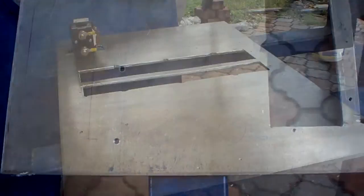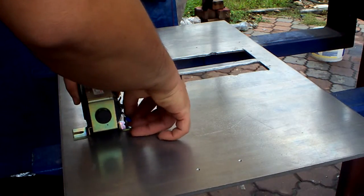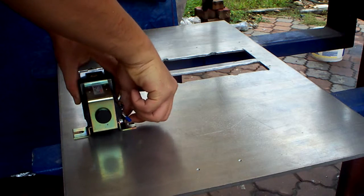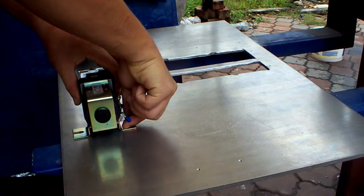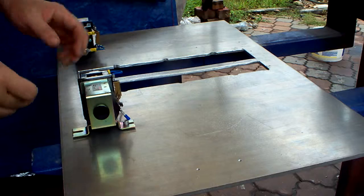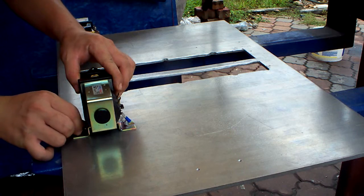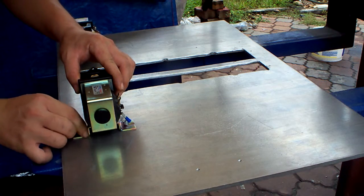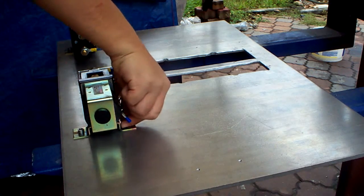So the tapping process is almost done. Test fit, see how it comes. Just a test fit, to make sure everything sits in place, and later on there will be some thin rubber sheets as seal, and then spring washer plus washer will be added on.